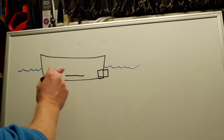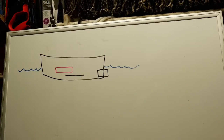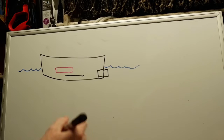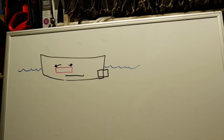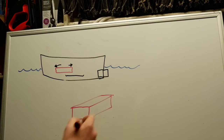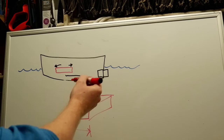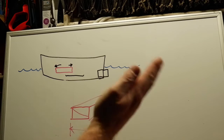So now that we have the boat lengthways and we put the diesel tank in lengthways this way, she will now not have the roll because widthwise the diesel tank is smaller than she is longer. So the diesel tank will be something like that, small square there, big rectangular shape there. So obviously the smallest area here is now the width of the boat. So when the diesel starts slapping about, it's not got as far to travel, which will stop the boat from rocking as fiercely.